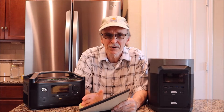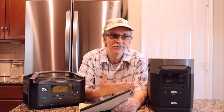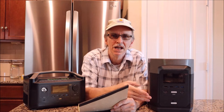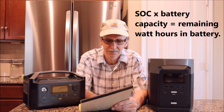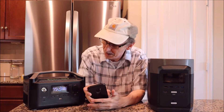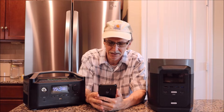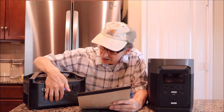If you had a 1,000 watt hour battery and it's full, it's easy to calculate — if an appliance takes 500 watt hours, you have 500 watt hours left. But what if it's at 60% state of charge? You need to convert that percentage to watt hours by multiplying the decimal by the capacity. For example, 0.74 times 288 gives 213.12 watt hours available. That's as simple as that.